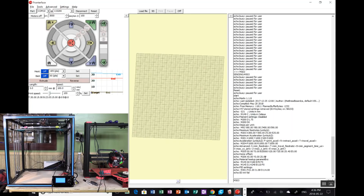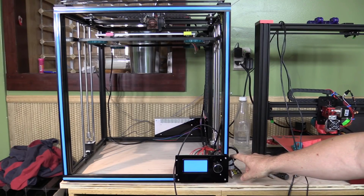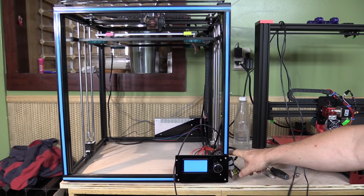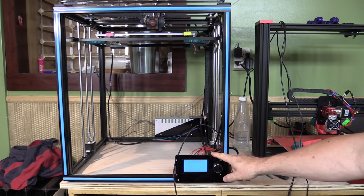So my only conclusion is that it's potentially the pins on the controller chip itself, the microcontroller, that maybe got zapped by a bit of static or something like that. Anyway, I'm not going to waste any more time on it because I do want to upgrade this anyway. So as you can see, not everything always ends the way you expect it to. In the next video for this printer, I will be upgrading the Melzi board to a RAMPS 1.4 probably, and I'll change this display because right now the SD card reader is on the Melzi board, and if I change that to a RAMPS, I won't have an SD card slot. So I'm going to put a different display on here, and that will give me access to an SD card slot again.